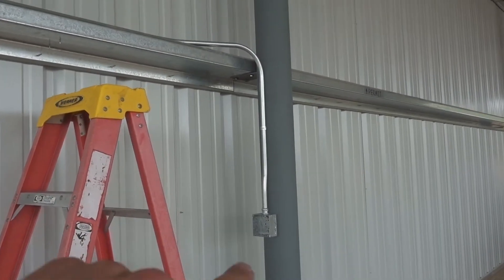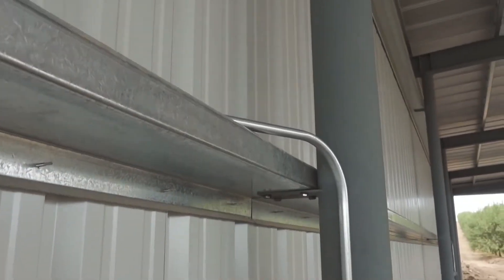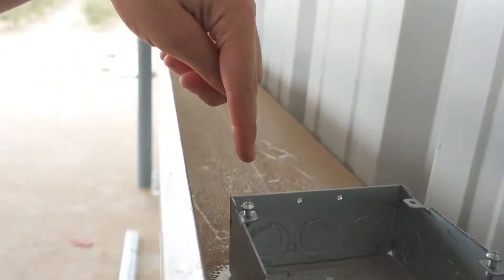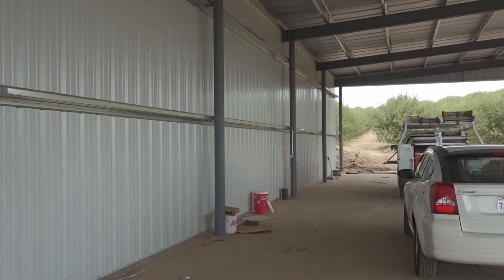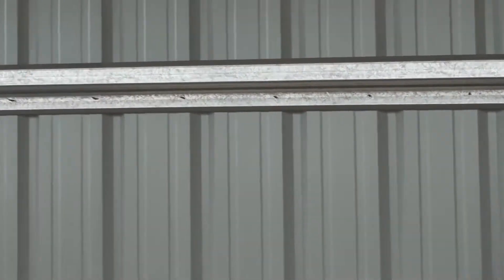We are back - it is now lunchtime. I'm going to show you one other thing I was working on: column plugs. We like to set plugs on the column for the farmer. You can see there's one here and another one right down here. What you do is pipe up with a 90, get kind of fancy with an offset kick 90, then hit a box, and continue piping down inside the girt line. That gives you a pretty clean pipe run for receptacles. You want plugs every other column.